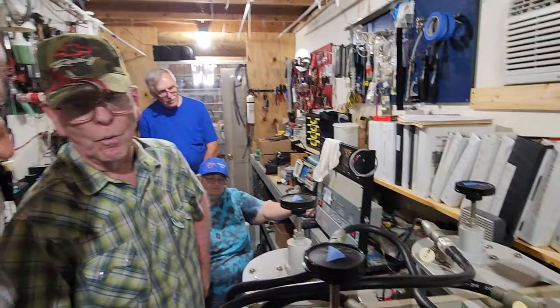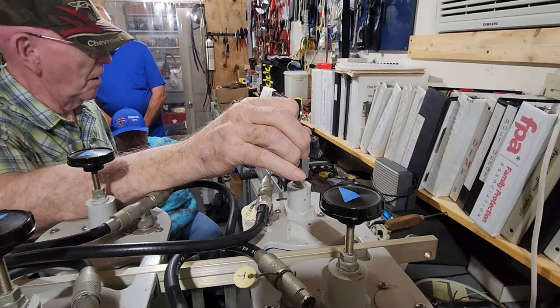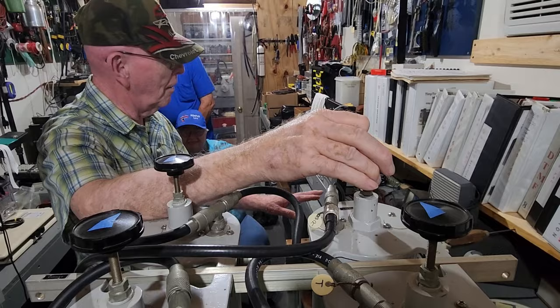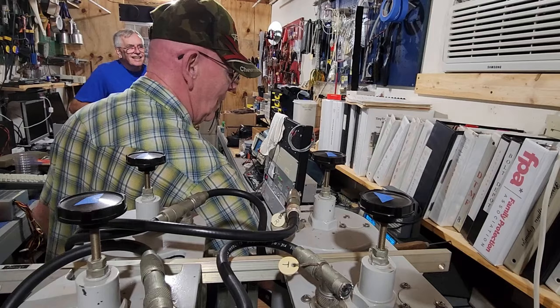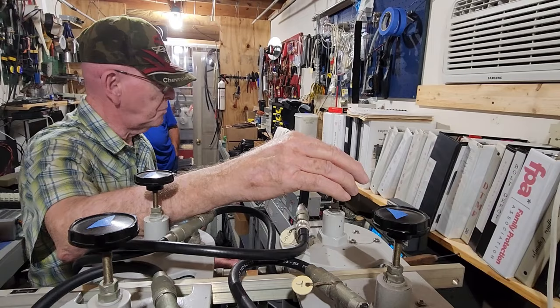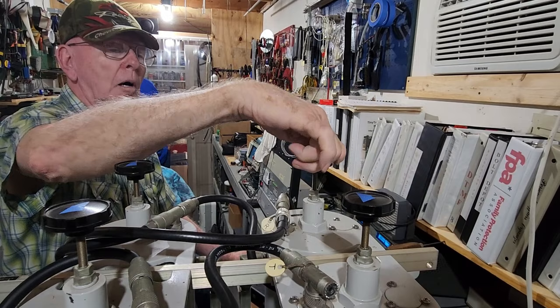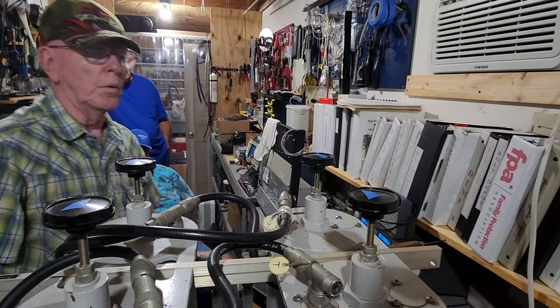At this point, what he's going to do is go forward, backwards, and forwards with that screw to find out where the midpoint is for that tone on the current voltage being sent out by the service monitor. Right now it's on a relatively high voltage just to make sure we can hear it. As you adjust the screw on top, you'll hear it get clearer and then more static as it goes back and forth. Then he reduces the power so he can lock nut. You can hear it's pretty clear. As he starts adjusting the screw, it's going to become clear and then static-y. Then he's going to reduce the voltage and dial it in. He screwed it too far, so now it's not on frequency. Screw the other way, it's back on frequency. Then you've just got to cut it in half — how many turns — and then cut it in half.